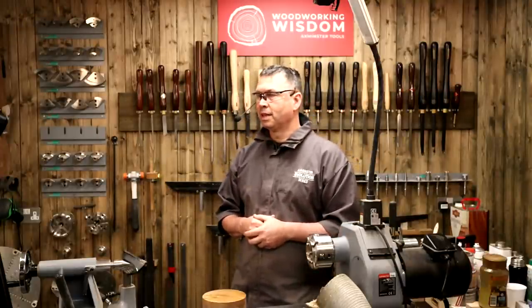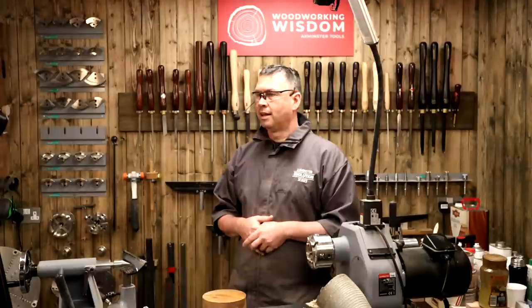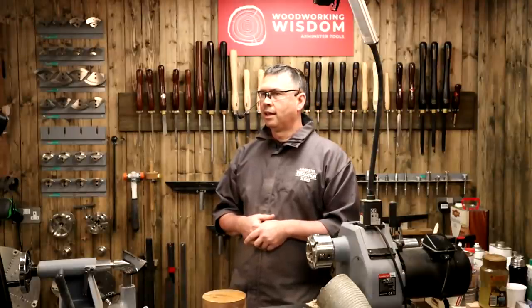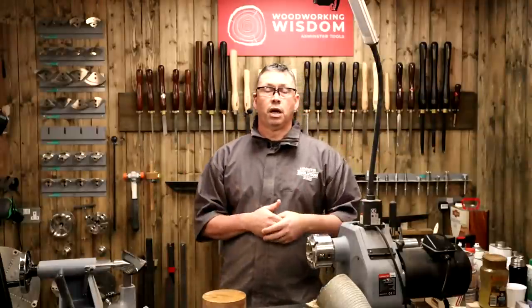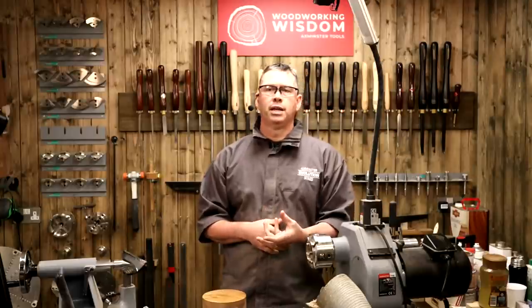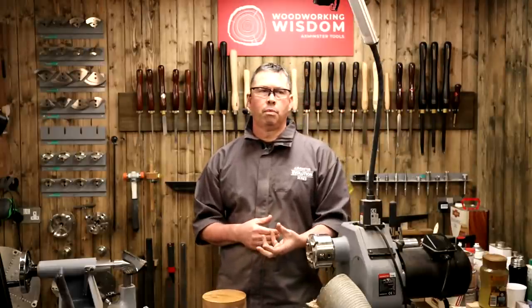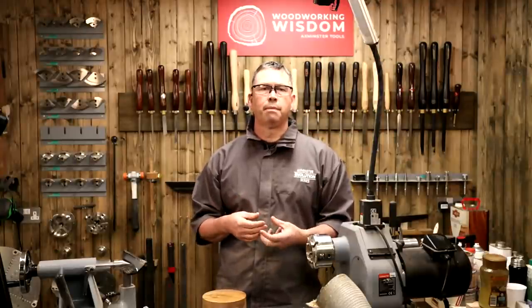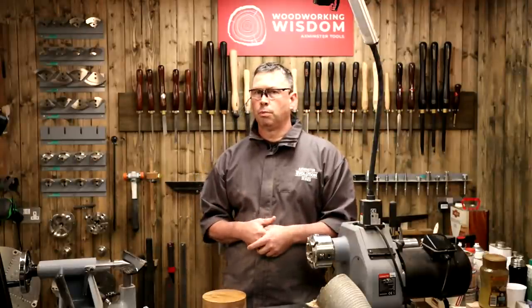Question from Mike. Would you use the same grain filler for end grain? Yes, no different. Absolutely, yeah. The sanding sealer, for end grain personally, sanding seal it first. What you don't want to be doing is trying to fill tears. The tears have got to disappear. So sanding sealer should do the job.